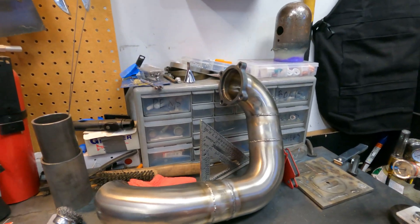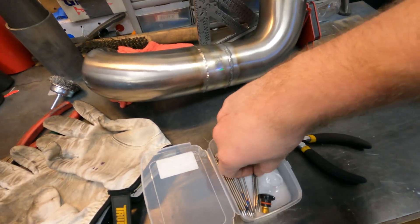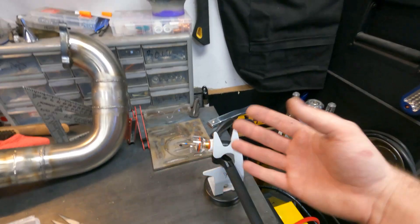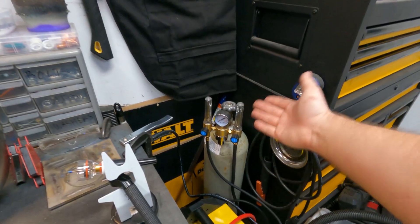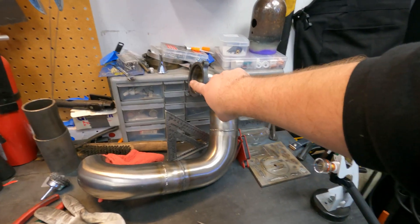Another really useful tip: for all your tungsten — I'm using 2% lanthanated — I would take all your tungsten, cut them in half, and then grind both sides. That way when you're using it, if you mess anything up, you can just easily flip the tungsten. And if you mess up both sides, you can just pick up another that's already sharpened. I have a dual regulator here for back purging the exhaust, because we want the exhaust to be very nice and strong. Back purging means you fill the whole cavity with argon, which creates a stronger weld.